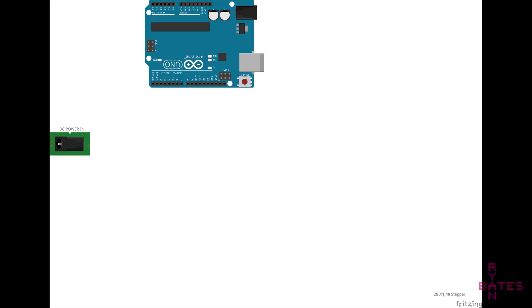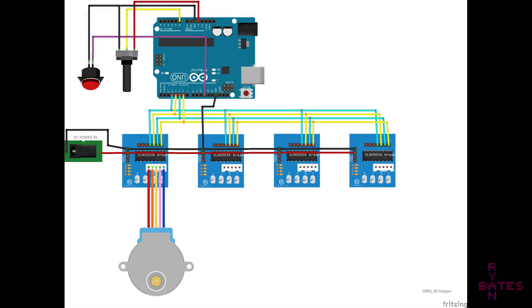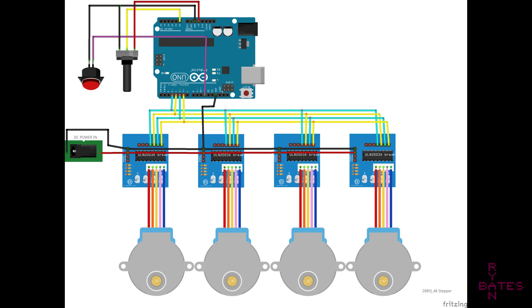Building the circuit looks like this. I added a reverse or rewind button to give some extra leeway when trying to set up a shot — it's unnecessary but it's fun to do stupid stuff anyway. This potentiometer controls the speed, which is capped between 1 RPM and 24 RPM in the code. A separate DC supply for the stepper motor is a must; I'm driving these motors at about 6 volts. The code just loops through moving the stepper one step while also checking the potentiometer value, which is mapped to the stepper's speed. Pressing the rewind button calls the stepper to reverse direction, hence the negative 1.